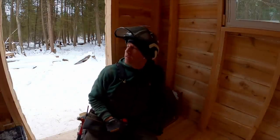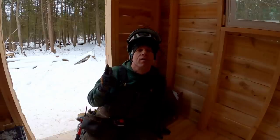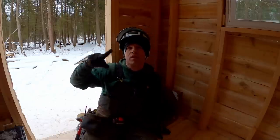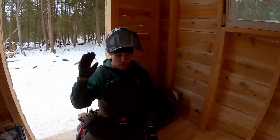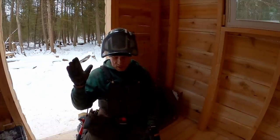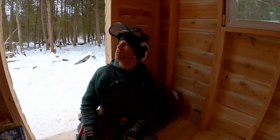Before I start doing that, I guess I need the door. I wanna get the roof on there. I've got drip edge that I got used that I think is plenty to go all the way around here. So I got to throw the drip edge on there, tar paper and shingle. That's probably like 1 to 2 days depending on the weather. Really, it should just be a day.